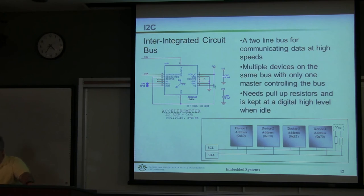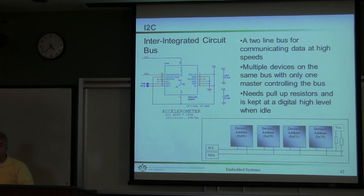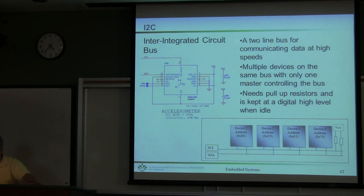Now, if we look at this example, we have internally some aspects of this device: power, ground, and the accelerometer, so it doesn't have an input line. My accelerometer is going to identify X, Y, and Z, and by the way, if this were another type of device, like one with a gyroscope inside, something we often call an IMU, inertial measurement unit, very useful for identifying both acceleration and your attitude, yaw, pitch, whatever. In this case, we have this device whose I squared C address is 3A.